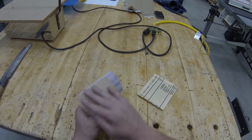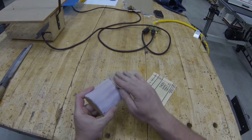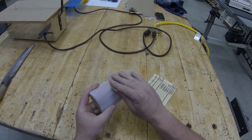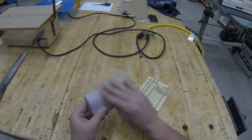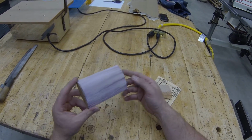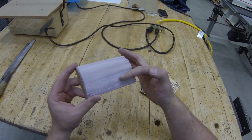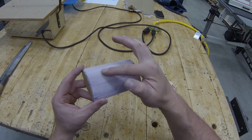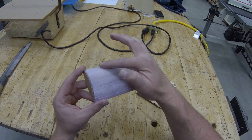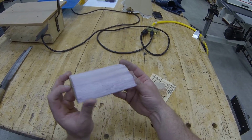And what you're going to want to do is sand the surface with the abrasive and remove any of the imperfections that you still have on the surface. Okay, so if you notice the difference between this side where I was sanding and this surface here, which was still rough from the file and the foam cutter, you can get a nice smooth contour that will work really good in the wind tunnel coming up.